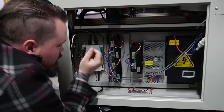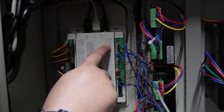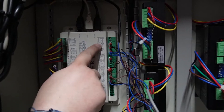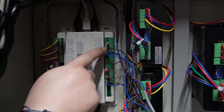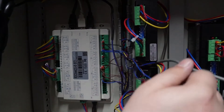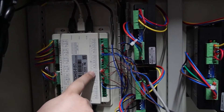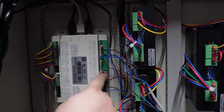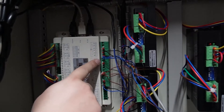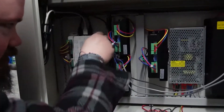Good thing we're swapping out the limit switches. I found where they're plugged in, and this is interesting — you can actually see where it says LMT, so that's your limits. You've got your Y-negative and your X-negative, those are the only ones plugged in there, and then there's a bunch of grounds — that's the blue. Both of the limit switches are in there, and all of the brown ones, which is the 24-volt power, are coming into this one. I was looking at the limit switches that came to us and none of them came with any of these connector ends, so you might need those ends as well.